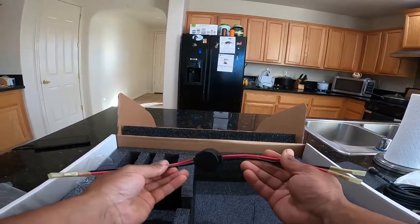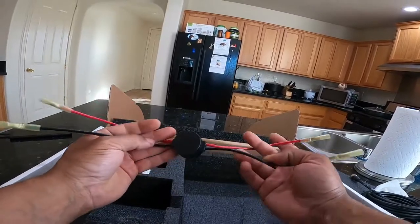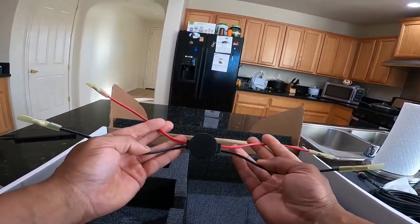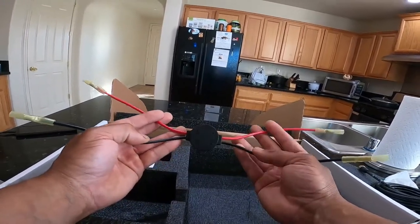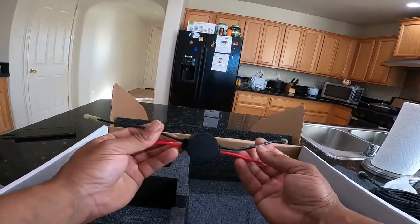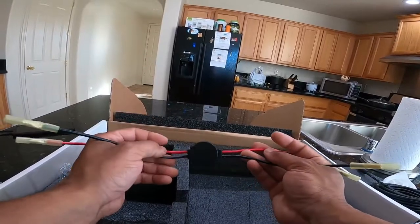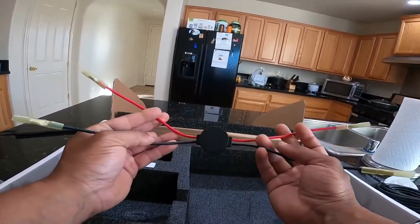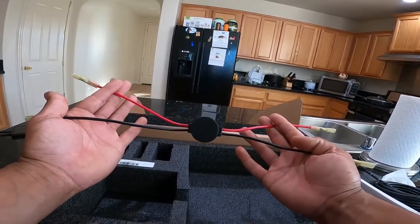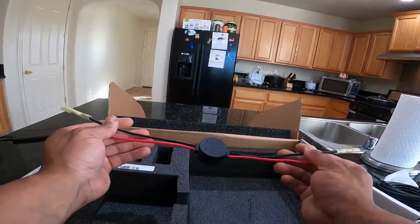And then you've got a choke. This thing is designed for all you guys who have onboard battery chargers — that have the charger running into your cranking battery, and then you've got a whole bunch of other things like your graphs and stuff powered by the same battery. Reading the instructions, it says that you need to cut the fuse ends off of your onboard charger and then run them through this, and then connect it to your battery to get rid of the noise that the onboard charger makes in your graphs.